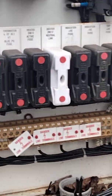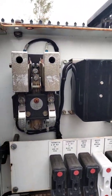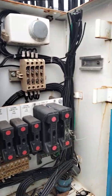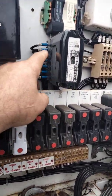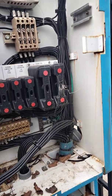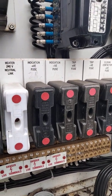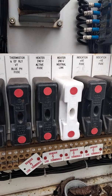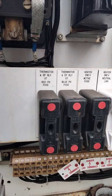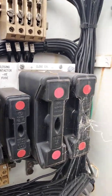The other three CTs are upstairs. If we open the cabinet up the top here, we have all our control wiring. We have basically an open-type 110-volt contactor, an active and neutral fuse, and a lot of fuse links. These contactors are quite interesting — you can actually change the type of contact, normally open or normally closed. We have fuse links here — the 240-volt heater neutral, heater active. The heaters keep the unit warm. We have thermostat relay and current trip, trip coil fuses, and closing contact fuses.